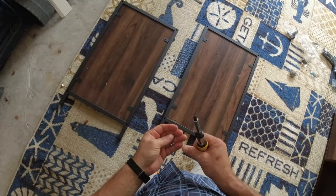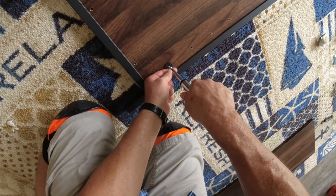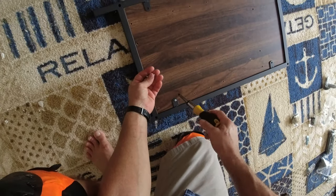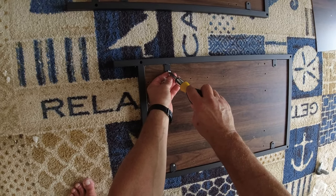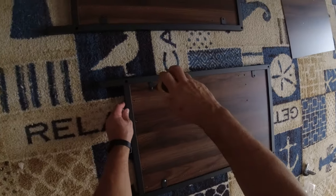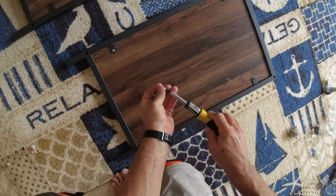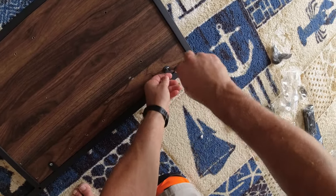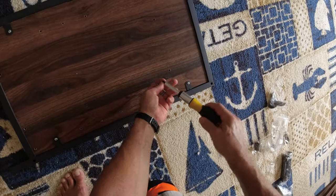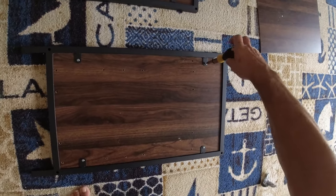So just do it exactly like you can see there, and then put the wood screws from the E-bag in there, and again, tighten them snug, but don't go to town with your super strength and strip them. Just fasten them down, so they're pretty good. If you snug them down, they're in there pretty secure. If you torque it down with your super strength and strip it, it won't be secure at all. So just snug it and it'll sit just fine.